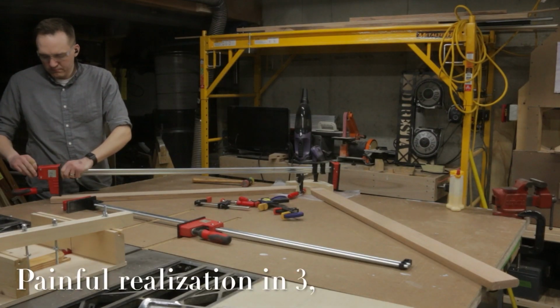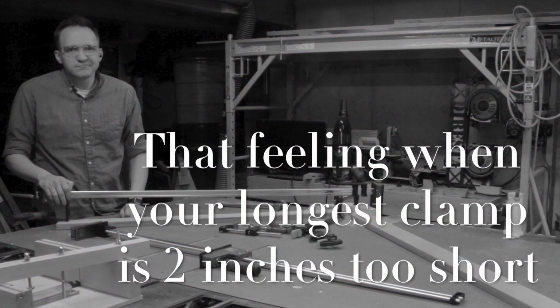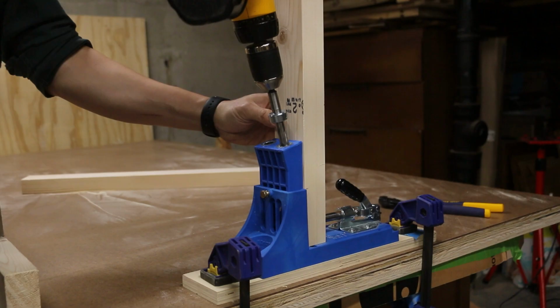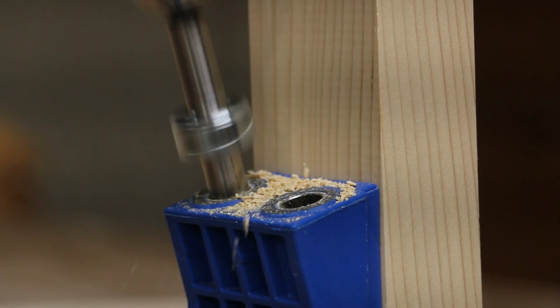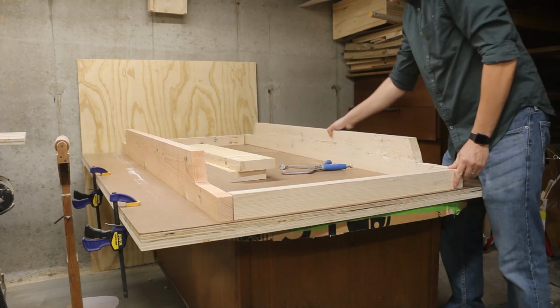This experience came in handy later when I was trying to use DIY dominoes to glue together boards for that fancy curved step. And bottom line, I think this is a good reminder that screws exist for a reason. So that's what I did here. I switched to tried and true pocket hole screws. Lucky for me, I only had to replace the cross piece. The dowels were still glued in the long board, so all I had to do was make sure the screws missed those dowels.